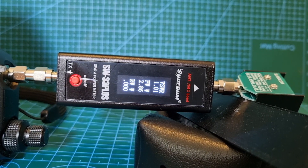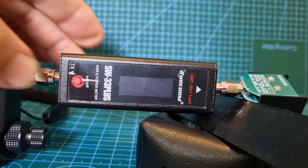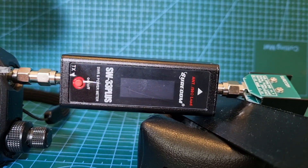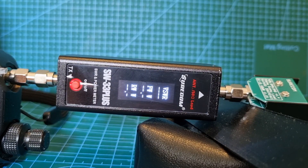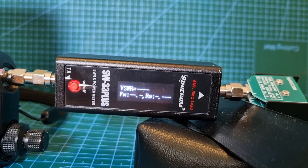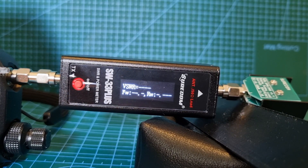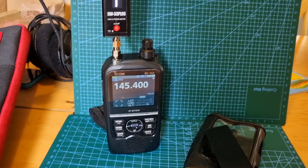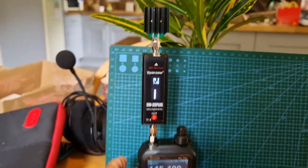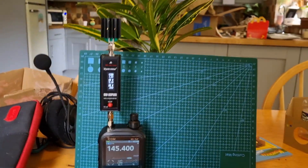Dummy load: let's go to high - 5 watts. Let's turn it on and off again. So we turn it around and key. Let's check the power - let's go to high. Okay, it's quite long when you put it all together. So let's just key it and then yeah, you're getting the 5 watts. Push again to get all the info. I think it's worth 30-odd pounds - it's a very quick way of testing it.